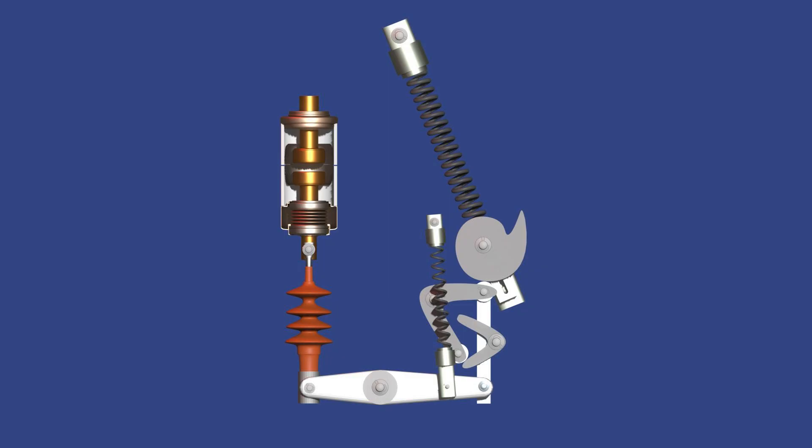The philosophy behind using a DC motor is that when there is a total power failure, the circuit breaker can still be operated. Whatever the condition of the circuit breaker — whether it is in an open or closed condition — the spring is uncharged, meaning it is in a relaxed, expanded condition, as soon as we switch on the motor supply. The motor starts running and, with the gear-lever arrangement, the closing spring gets compressed. The hook part of the mechanism mechanically latches or holds the closing spring in the charged or compressed position.